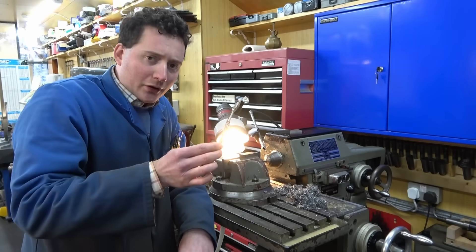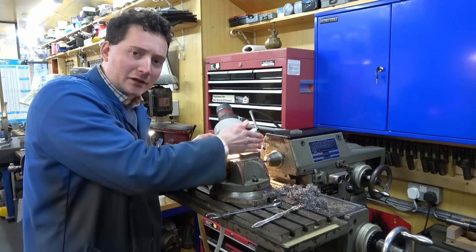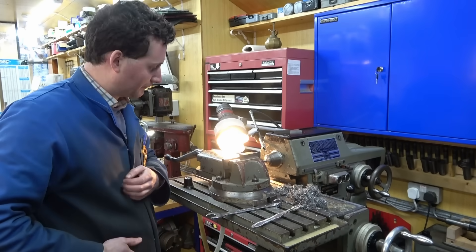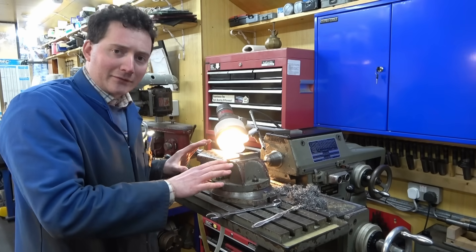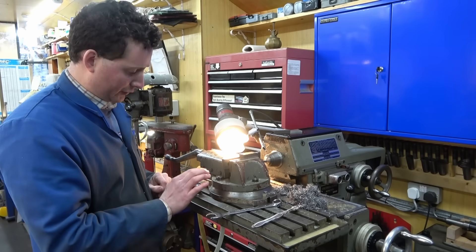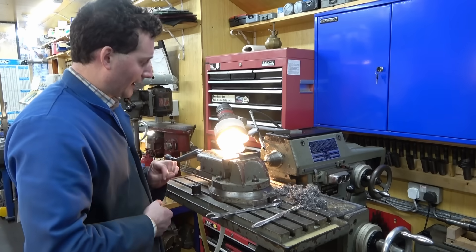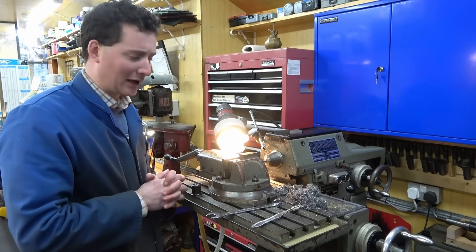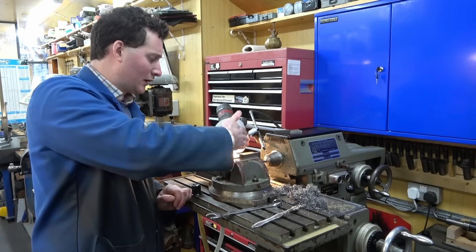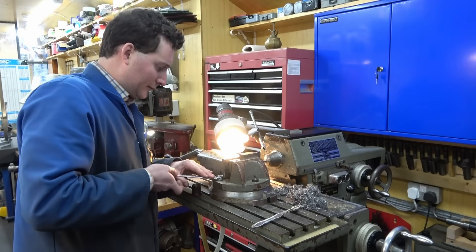Using my brother's toothbrush I've prepared the vice for resetting. So far I've milled the size of the step square, but next I need an 11-degree angle on both sides. Based on experience with this vice, using some magnification I can set it to within about 0.1 of a degree just using the protractor. Given that these features are what you could call visual, that would be perfectly adequate, so I'm just going to use the protractor and mill up and down to do the two angles — 11 degrees one way, 11 degrees the other.